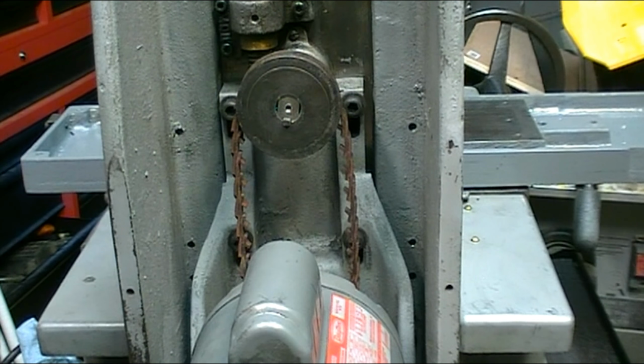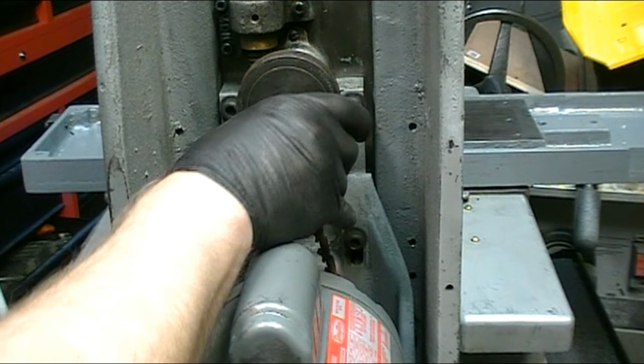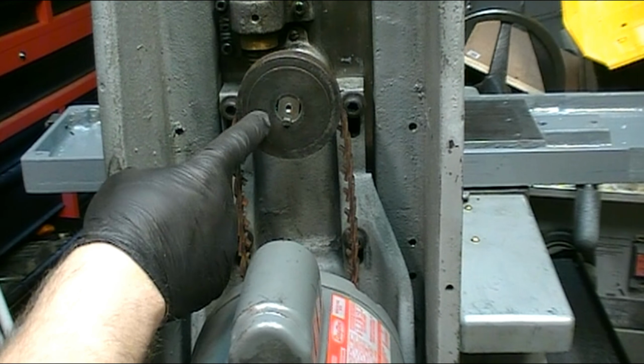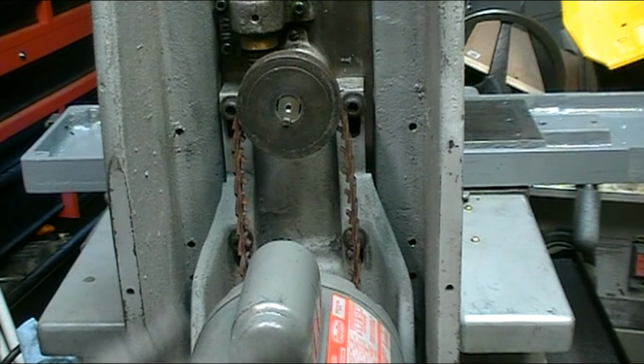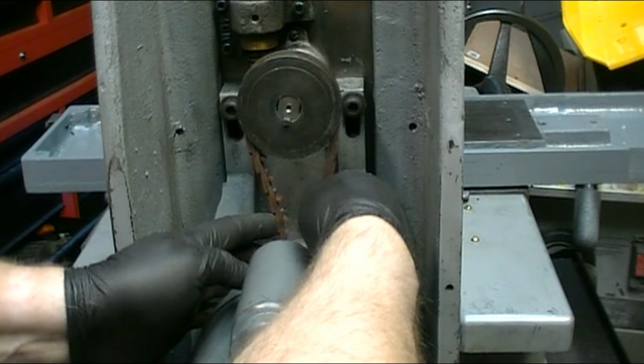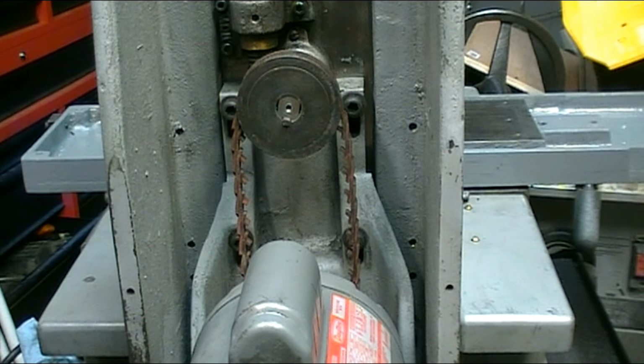I found a different pulley to fit the motor that is about the same diameter as this pulley, so that'll give me around 3,500, which is where I want to be. I'm going to have to get a little bit shorter belt. So until I get the new belt, see you later.